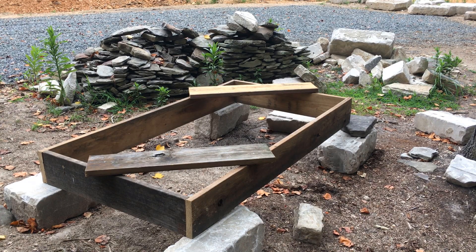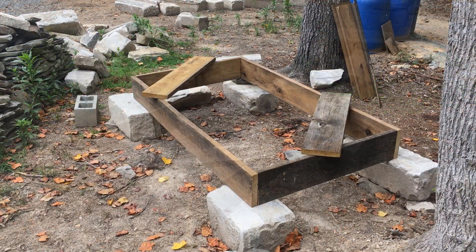I thought about using the leftover rock from my stone columns — that pile on the far side of this shed foundation — but I want to save them for some future use. Instead I used these big block limestone stones I had gotten from Pennsylvania. I thought they would make a much easier and more attractive foundation and help this shed blend in with the future home being built with a lot of these stones. Once the foundation was exactly as I wanted it — all level and stable — I removed the corner boards I had temporarily spiked in place to keep the frame square, and used them along with a few others I had cut to create joists.